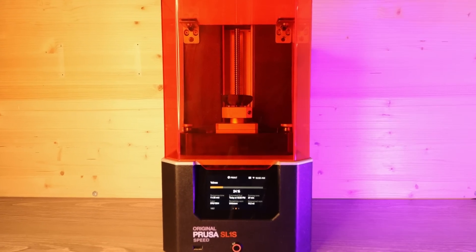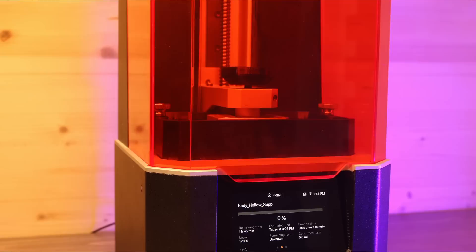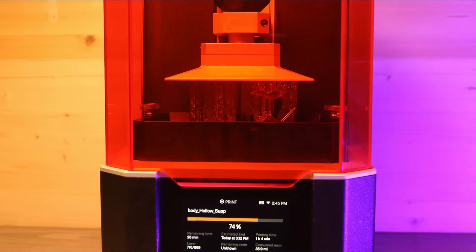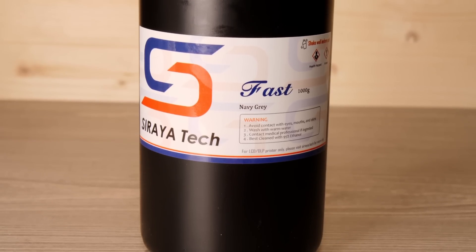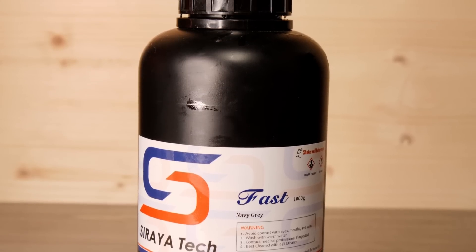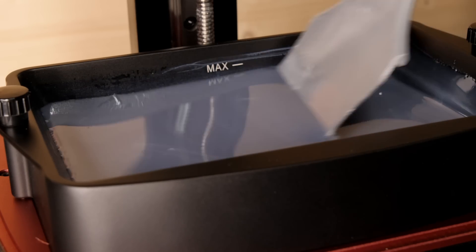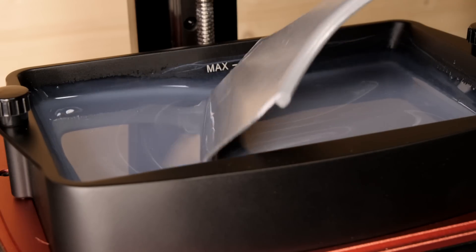This happens within a couple of seconds and that's what makes it so fast. I did a resin time-lapse of a print and my old Canon camera barely had time to reset after every photo it was taking. Now this also gives you an added benefit. Some resins, like the Siraya Tech Fast Navy Grey resin, are very pigment heavy in order to give them that matte finish. With standard MSLA printers, having the VAT constantly just sitting there motionless, these pigments can settle at the bottom of the VAT.